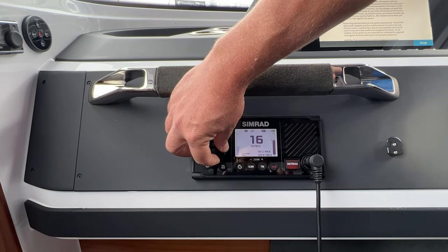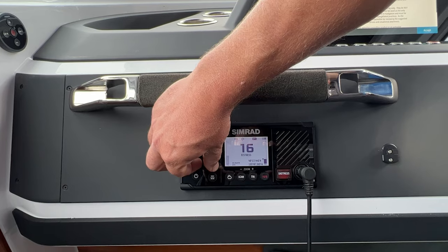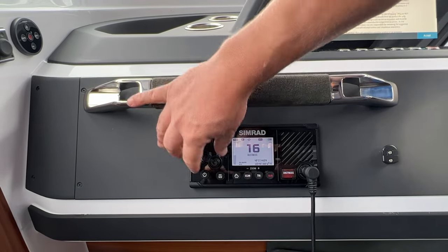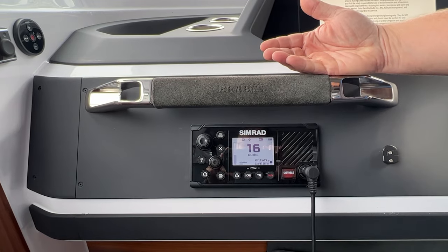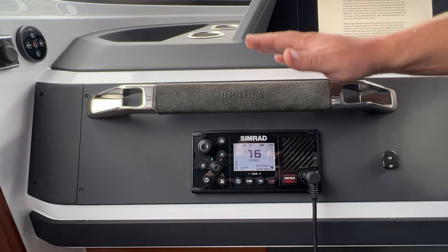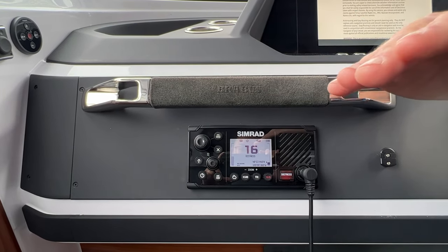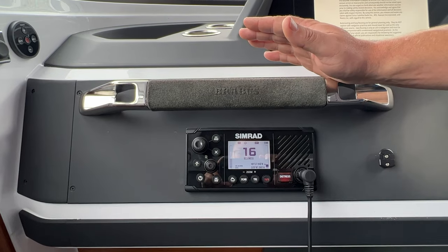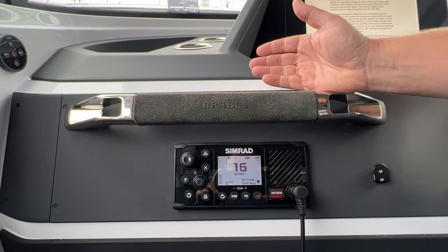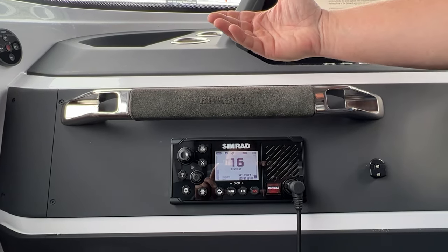If you put your Squelch all the way down on zero, you will get background noise. And here it comes. There it is, right? So Squelch on zero means that the radio itself is not cutting out any of the background static. When we're talking about radio waves, that static is always there, right? So most radios do have the Squelch feature so that you don't have to listen to that all day until someone makes a call.